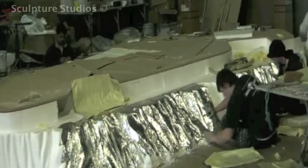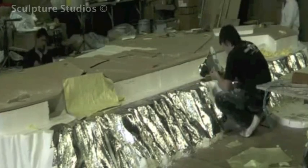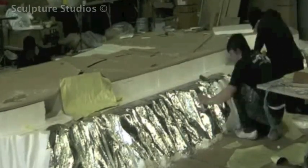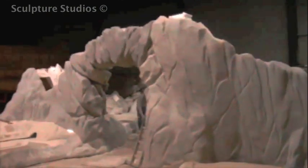When we say we cover it in foil, people often underestimate how long something like this can actually take, especially with this kind of coverage area and the guarantee that there aren't any gaps. When it's all sealed, we use a Class O rated resin so that it's fireproof for indoor use, and we apply four ounces of glass fiber mat over the whole job. Around the bases, where the set might be kicked or bumped into by the public, we go on with a six-ounce build-up for extra strength.